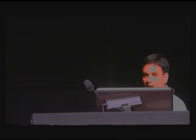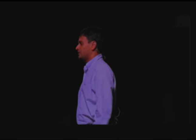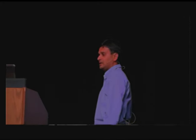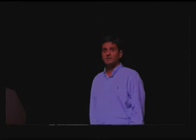Thank you, John. In this presentation, we'll be talking about the energy efficiency improvements in AMD's next generation processor codenamed Carrizo. Carrizo is AMD's sixth generation A-series APU designed for notebook and convertible platforms. Carrizo had one main design goal, to deliver generational performance and battery life improvement while remaining in the same cost-effective 28-nanometer design node as the previous generation SoC, Kaveri. This design goal really forced AMD to improve the energy efficiency of its IPs. And that's what we'll be talking about today. I'll quickly introduce the SoC, deep dive into the energy efficiency features in graphics and multimedia, and summarize with some results.